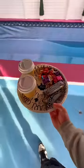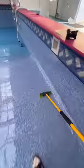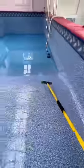The customer called, says he's got a leak and he reckons he needs a new liner. The problem here is with the two sets of steps — one of them is longer than the other. The longer ones were placed in the shallow end and the shorter ones were placed in the deep end. The feet of the longer steps were resting on a weak point of the liner, so every time the customers got in and out it was causing damage, which then caused two holes and the pool to leak.